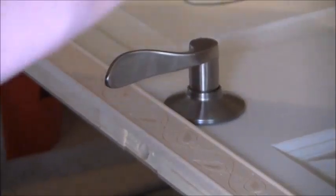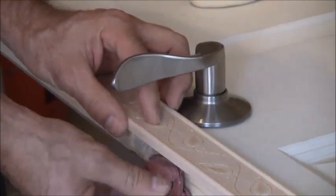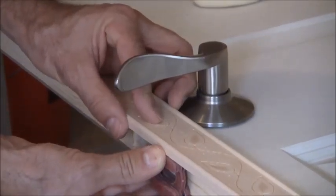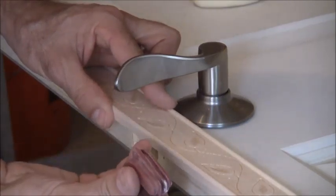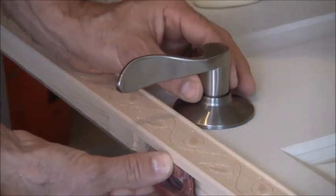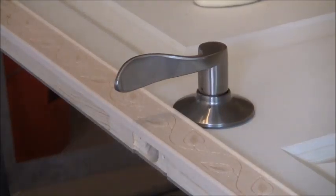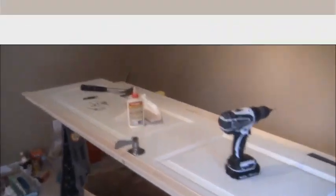Then I put my Astragal strip in, and then just using shims like this, determine exactly how much space I need in order to set it up. So to have a little bit of a gap there, I'm going to do 5 1/8 inch shims, and that way there'll be a little bit of movement here. So then what I do is I take, let me just back out of the door and give you a full perspective here.